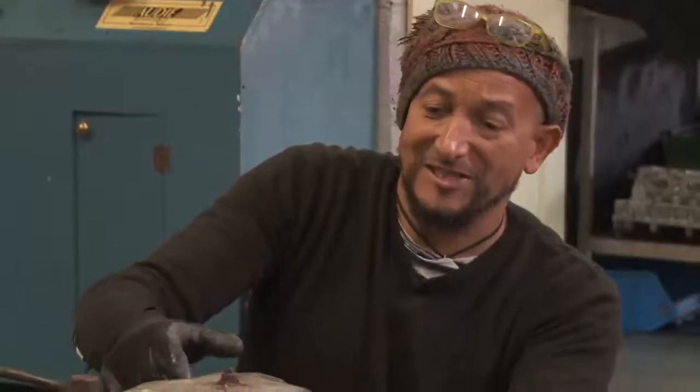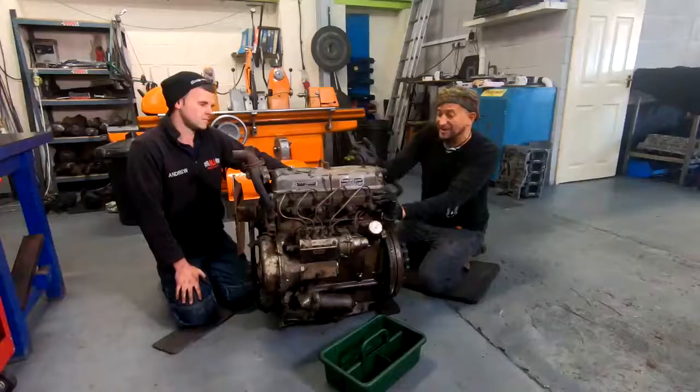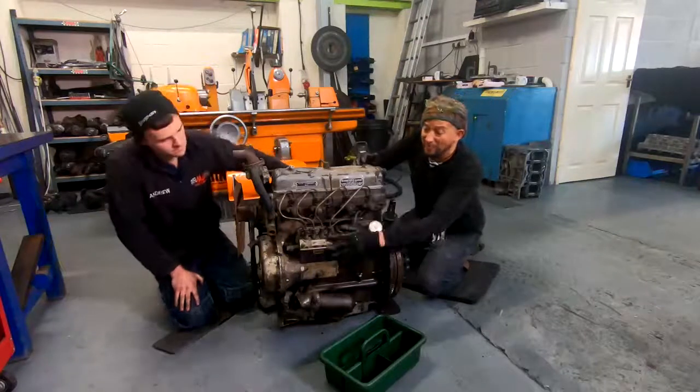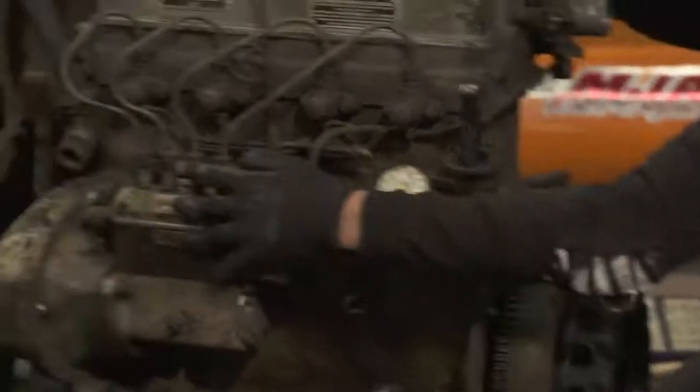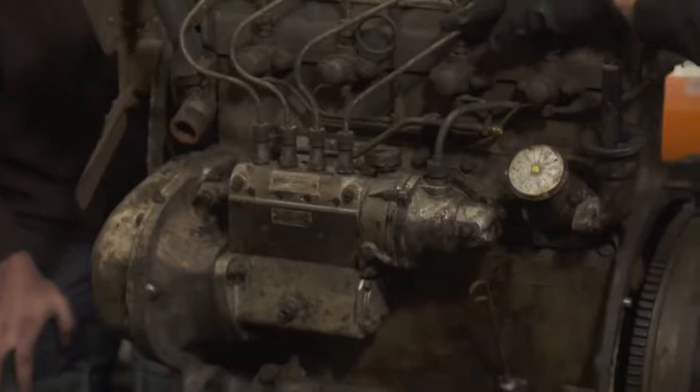Off will come the cylinder head — and it's a heavy cylinder head because this engine is a great big cast iron lump. I reckon that farmers use their tractors until they go no more, so I'm expecting that inside this engine we're going to find lots and lots of wear, because this is a little four-cylinder cast iron diesel engine. It's very, very heavily built — real proper heavy construction, but it means that nothing is lightweight. Once we've got the cylinder head off, we can see the pistons inside the bores to see if they're serviceable or not. If they're unserviceable, then we'll have to strip the engine back even further, which will mean taking the fuel pump off and making sure that we get all the timing marks right. Because if we take the fuel pump off and we don't know where to put it back, it needs to be synchronised with the engine so that it will actually operate the injectors at the correct time. If the engine doesn't work, then it's just a great big lump of cast iron sitting at the front of the tractor.